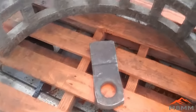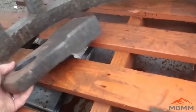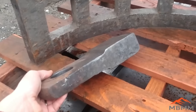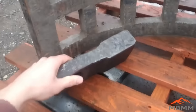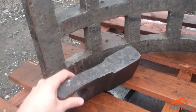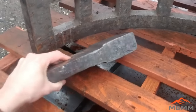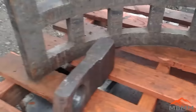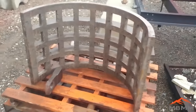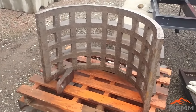And then here's the hammers. We pulled one out so you could see very, very little wear on this hammer. It's drop forged manganese steel for extra long life. They work harden. And I think there were some concerns in some of our earlier YouTube videos about the wear on the machine. But you can see now after we've run some samples through the mill and through the screens that the wear is pretty minimal. And I think it's going to last a long, long time.